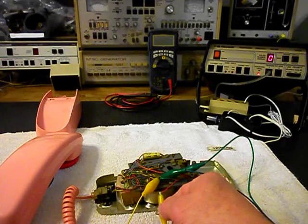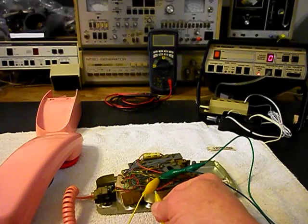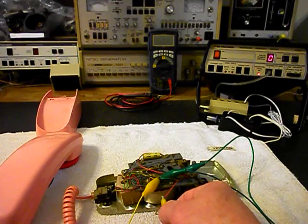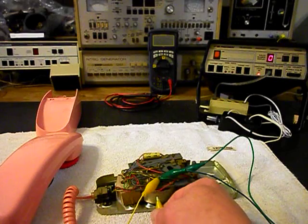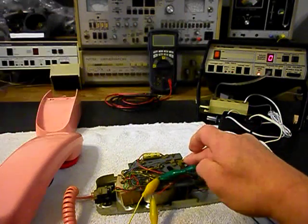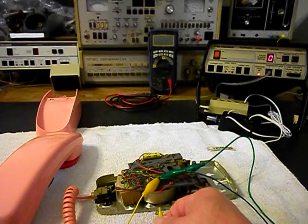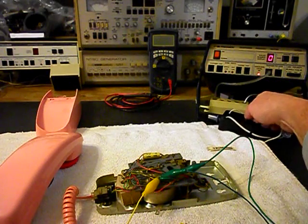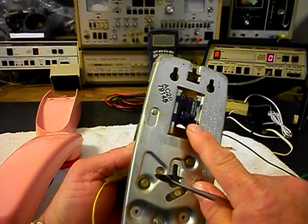Although we may not be getting static at this time, it's still when I hang up or take the wire off — you can hear that dial tone take a dive when I clamp onto it. And now our static is starting again. You see how the dial tone came up. We're going to hang the unit up again — the analyzer never unseized, so it's still off hook. The static will come and go. So what we have here is a bad modular port plug, and we want to change that.